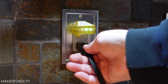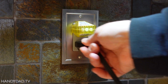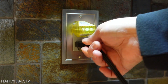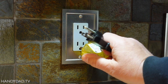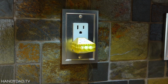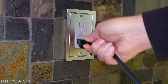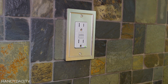Now there's nothing wrong with the breaker, so I'm going to plug in the coffee pot and my tester and wiggle it to see if maybe there's a loose connection or something that might be causing the GFCI to pop. But nothing is happening there.